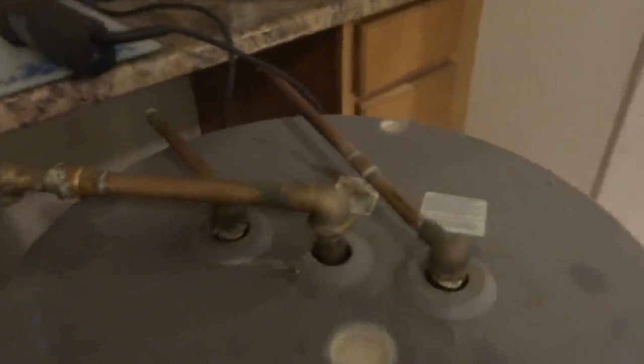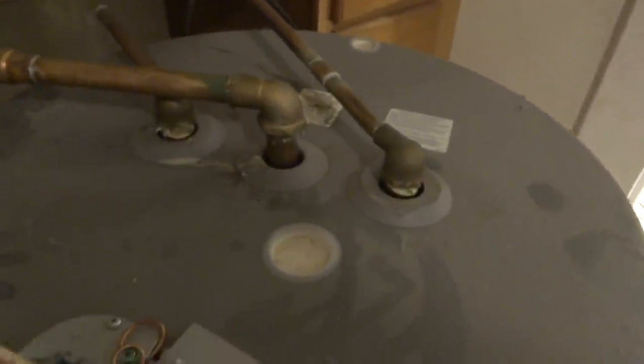I'm going to pull this tank out and take a look at it. Look at the way he's got the relief valve - it's supposed to be in the top, because there's a probe here and that probe has to be down inside the water. That's not legal like that. Look at this wiring - this is all illegal. Crazy. That was Jim plumbing. They're supposed to be so great. You don't know who the hell they're sending - so much for their name.